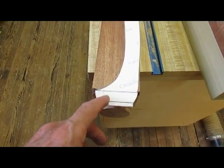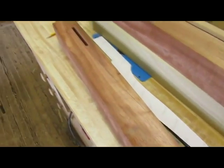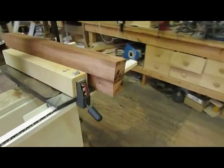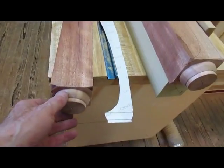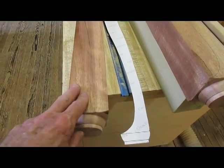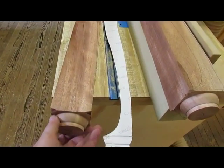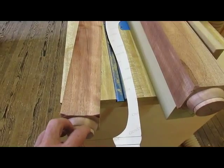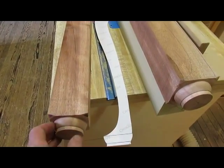The pad foot here is seven-eighths of an inch. What I did, like all of them, is I mortised the ends while it was square — these are the ball-and-claw ones over here. Then I turned the pad foot while it was still square. Some people cut them out and then turn the pad foot; I've always done it this way. So that's a two-and-a-half inch and then a two-inch pad that's a quarter inch high. They came out all right.